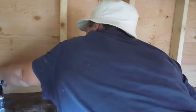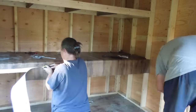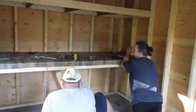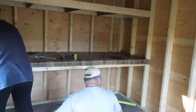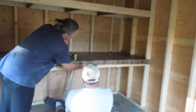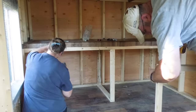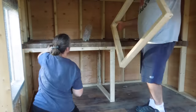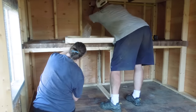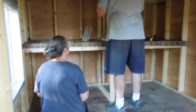The reason why we use linoleum or vinyl is because it makes it much easier to clean. It does make it a bit slipperier for them but if you put enough shavings down that helps, and in cleanup it makes a huge difference. This is pretty tedious — I take a lot of time doing this because I can really only do this once since we build on top of it. Staple it into place and we are ready to move on. Thomas is measuring out the division area between the two bottoms — there will actually be four pens. The floor I'm working on now will be two pens and on the bottom will also be two pens. I'm also putting nails in — I know I stapled the vinyl but I put nails in as well just to make sure it doesn't move.